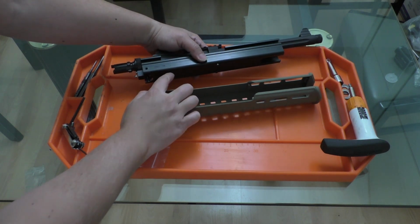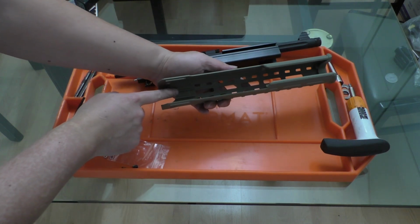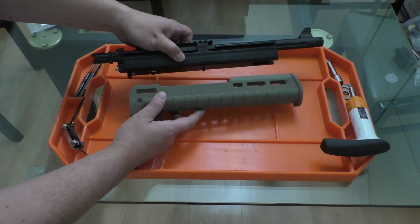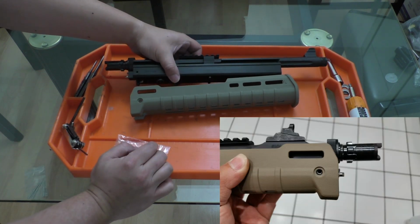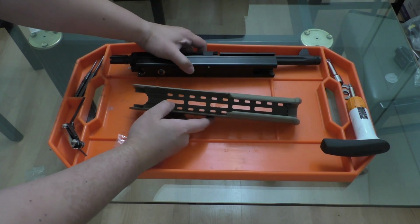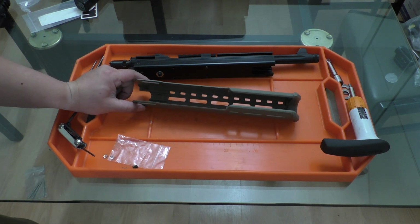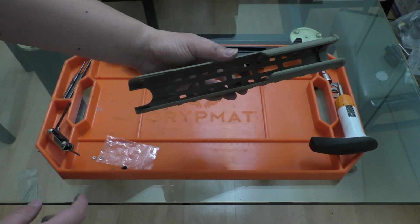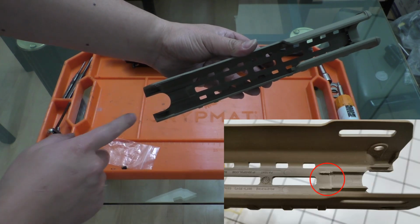Additionally, because I also had to use these washers over here, those washers don't fit between these two grooves. And once again, the result is this whole assembly sits a bit too high in the polymer handguard. And that means that these side holes don't align. So I fixed the front one by not using those two lock washers, but for the rear, I'm probably going to shave down these ridges just a little bit to make clearance for them so that the whole assembly can align properly.